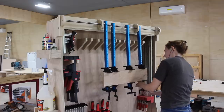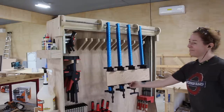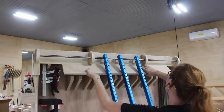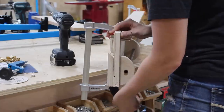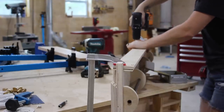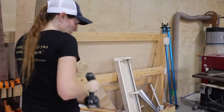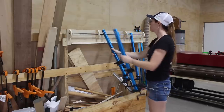There was still a little more to figure out. Instead of having the clamps hang vertically, I wanted them angled out to make feeding in the boards easier and to push the glue-up out away from the rack so dripping glue misses it. To achieve that I cut off the 45-degree angle between the two cleats and extended the board down further so I could attach another board to push out the clamps a bit lower. I took the rack off to make attaching the board easier but didn't use glue since this is an experiment and I know I'll need adjustments. I'm so excited to try this on my next few glue-ups. I also placed a mating cleat on my lumber rack so if I don't want it on the clamp rack I have another option besides my workbench.